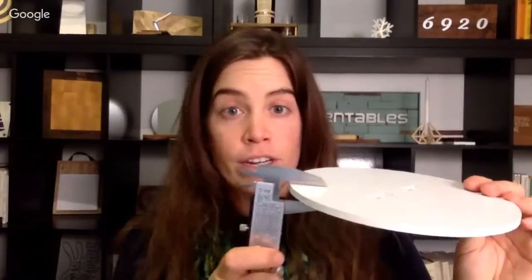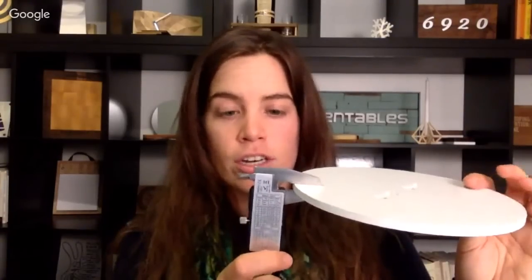So even though I was told when I purchased this item that it was a 1/4 inch thick, there's always a little bit of variance in materials. Nothing is ever precise. So I'm gonna use my digital calipers, and it's a very easy thing. I just kind of cinch it here, and I'm getting a reading here of 0.225, and it's kind of hard to see. Yeah, 0.221 is the actual thickness of this material.